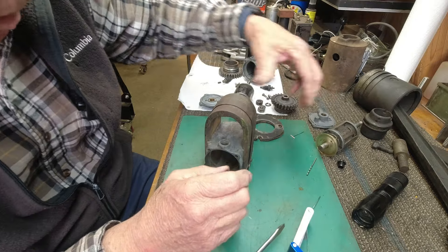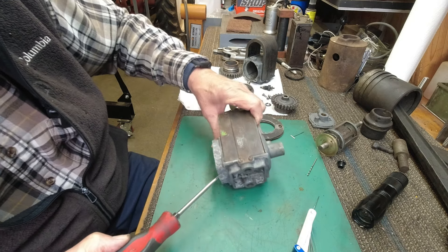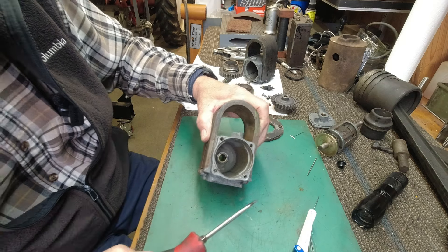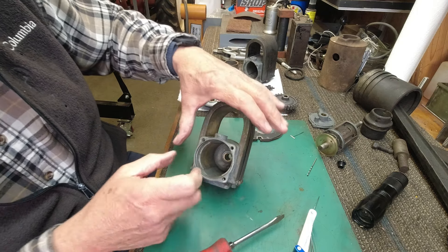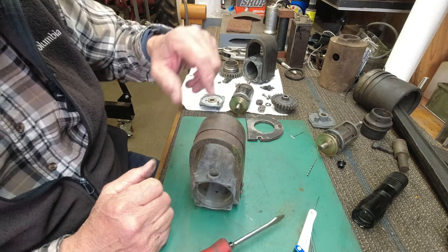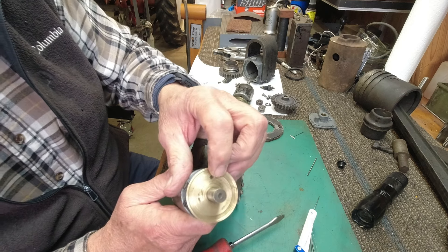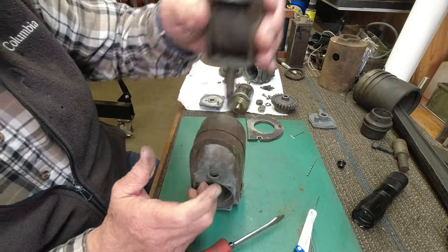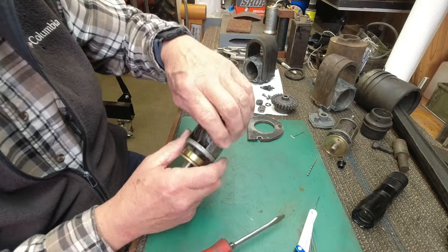What I think happened is: I see a crack right here in the housing — it's beginning to crack. I think it's pot metal of some kind. I think it's deteriorating from the inside out and has actually pushed in on this part, which is why it locked up. Also on this armature, where this slip ring runs, that's probably 20 thousandths deep — it's got a lot of wear on it. The housing is pretty well junk.